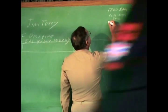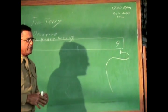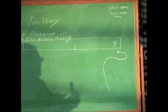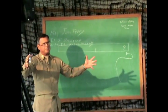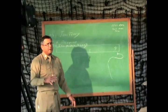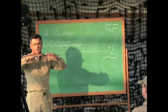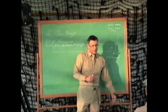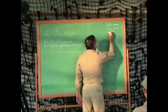Do that twice. Then, does everybody understand the feathering, what that means? The props can change pitch. This is a twin engine aircraft. It is designed that when you're flying, the props are in one pitch, taking a small bite of air. But if the engine fails, that prop at that pitch becomes a huge trash can lid that you're pushing through the air. It creates a tremendous amount of drag. Airplane won't fly. Airplane will just take you to the scene of the crash. But these props are capable of being feathered, so we can turn them flat to the wind, to the airstream, and the airplane will fly. So it's essential that we not only cycle them and get the warm oil in there, but we test to make sure that they will in fact feather, because your life may depend on it. So we cycle the props twice, and then we do a feather check.